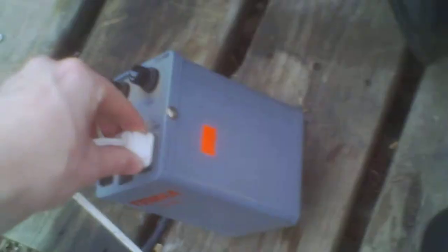Depending on how the thing is connected — and especially considering this thing has an unpolarized plug on it, which could go either way in the receptacle — one of the legs of the battery may or may not be at 120 volts RMS relative to ground. So that would be an electrocution hazard.